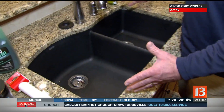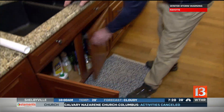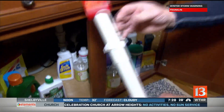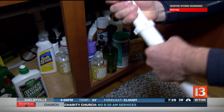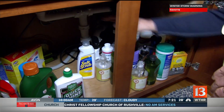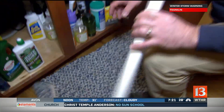So today we're going to look at the kitchen sink — various things, first of all inspecting the kitchen sink. This is a place where we get a little bit of water underneath the cabinets, and because of all the normal junk we have underneath here, people don't realize this is trap material. Watch this — they pull right out, even though that's the proper seal. So you want to get in there and make sure there's not water, because that water will either go down in the crawl space, or if you have a wood floor, it can really damage a floor. So check that out, make sure there's no water in there, because a lot of times we're not down in there looking.